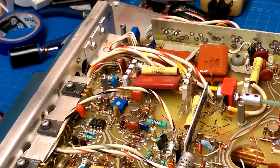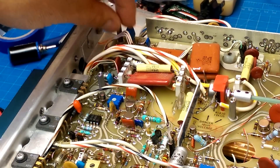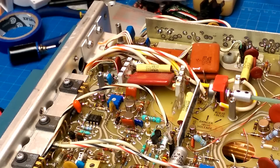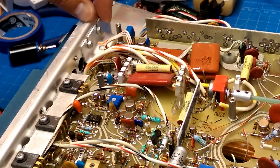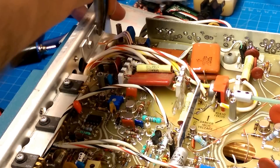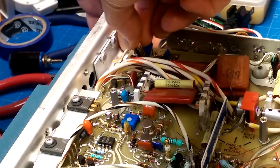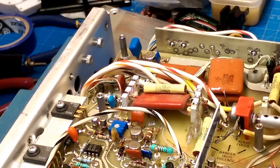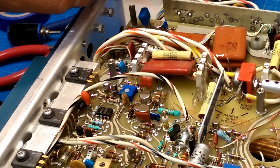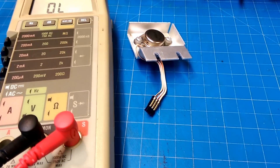Where those are physically located in the circuit is the upper left-hand corner. We find that by looking at the grid location and the grid schematic. We've got to test C14-16 and the transistor, which is mounted in a case. I can remove it — it's just got a couple of nuts holding the heat sink on. It's nicely jacketed and you can just pull that puppy out like that, which gives us an easy way of testing it.